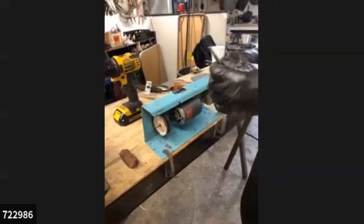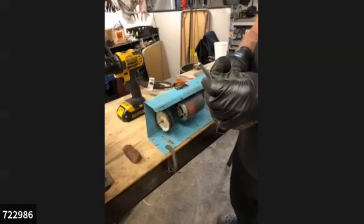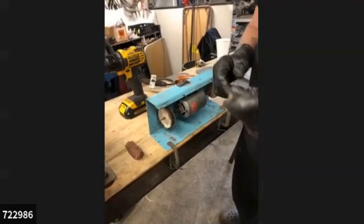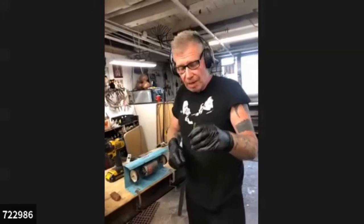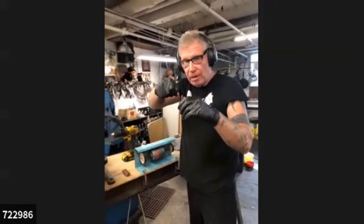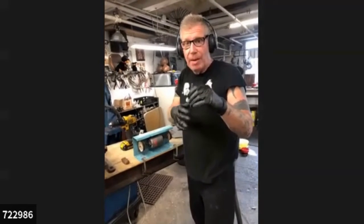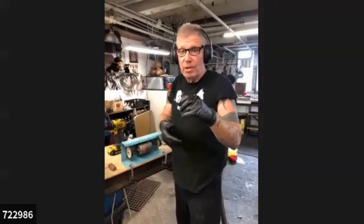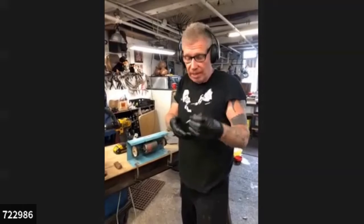Until I'm sure this is a mirror finish on there. Now the mirror finish on these tools is essential, because when you're doing the actual repoussé, you're tapping the hammer and dragging it along. And as experienced blacksmiths know, if you have aberrations in the surface of something that you're planishing with, it could catch in the material or leave an indent in the material